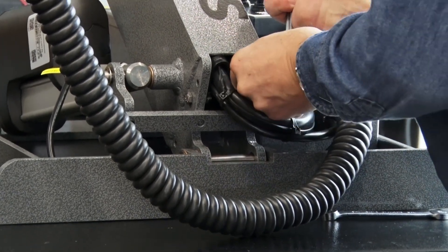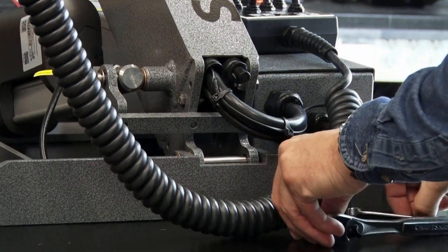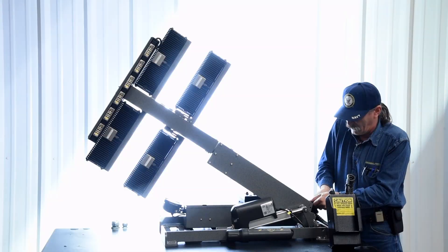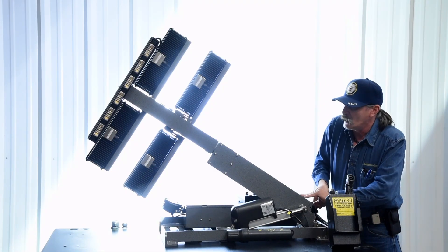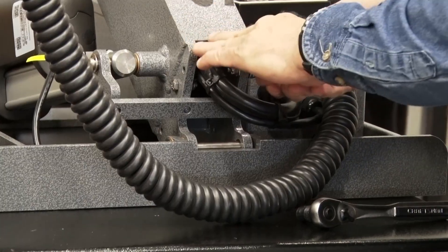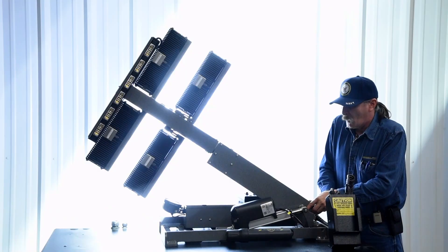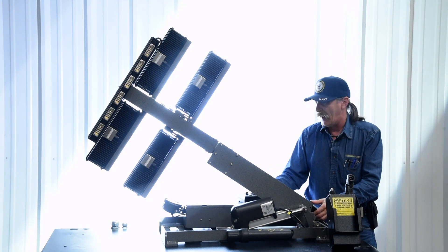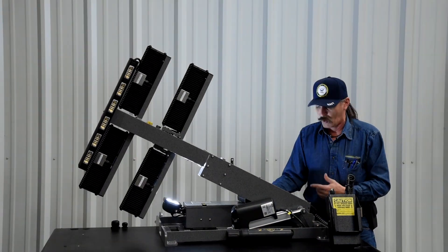By rotating this either down or up — and a wrench is sometimes better than this for setting it — just by turning that outer bolt and pivoting the mercury switch, you can tell right where that mercury switch is. So this one will not go down any further from that point. At this point here, it will continue to go down, so your lights are your indicator of that. This one would do a tomahawk now if I continue to lower it down.